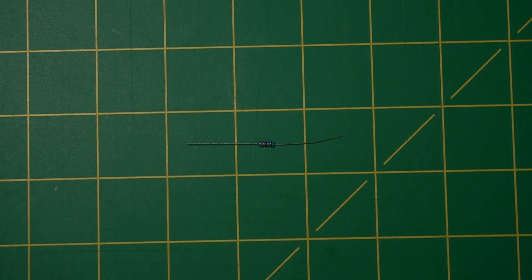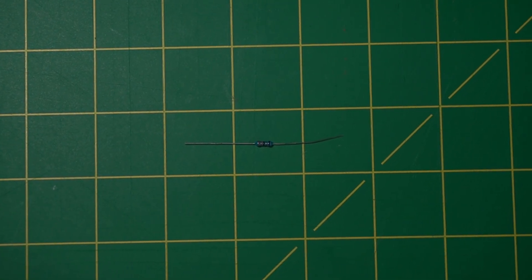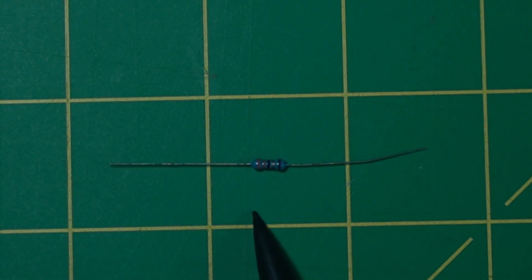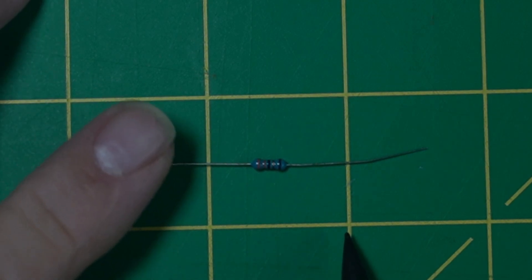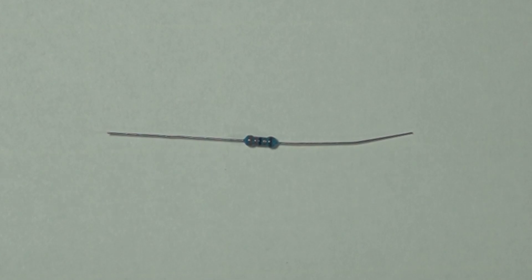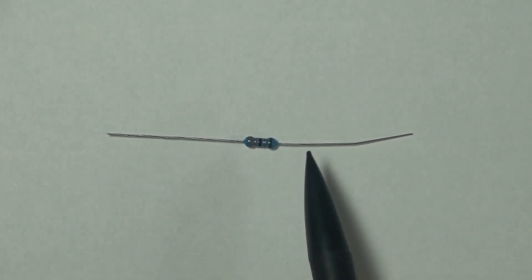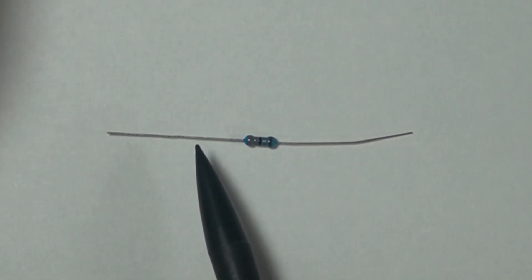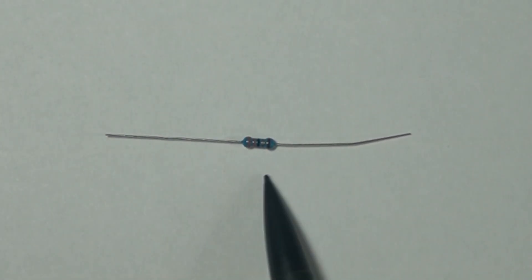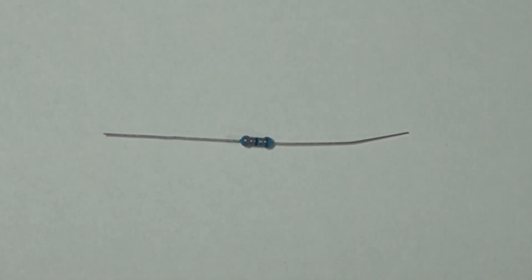What I'm going to do — this is a 33 ohm resistor, measured 33 and a half, close enough. I'm going to cut it right about here and here, bend a little tab like an L on both sides, put a little bit of solder on the old resistor, set this thing, then put a little more on the other side and solder them. I'll probably do this off camera though, because this thing is tiny — it's like the size of a pin.